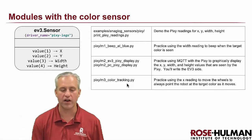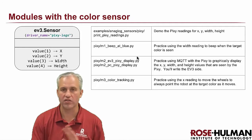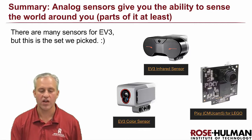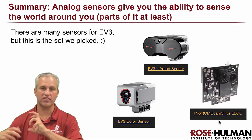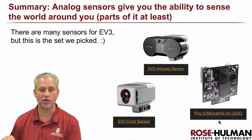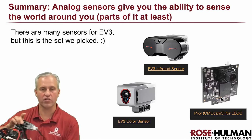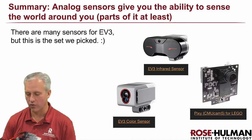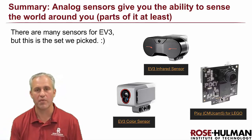The modules won't push you that hard — the hope is they'll be fun and you'll learn the API. The API is just values 1 through 4: x, y, width, height. That's everything you need to know. That wraps up analog sensors. In class you'll use color sensors for line following, the infrared sensor for the beacon pickup challenge, and the Pixie camera as the most impressive sensor. Download PixieMon, but you don't technically need it — the button on top can do everything. Hold it down until you get a red LED, let off, put your target color in front of it, press again, and you've taught it that color. Good luck!